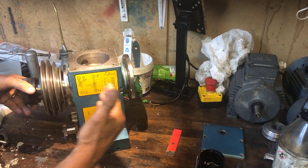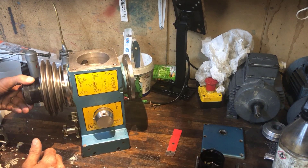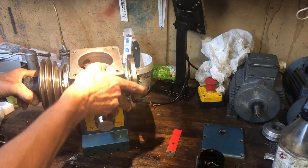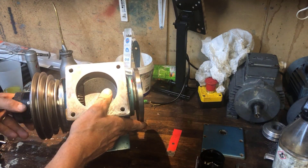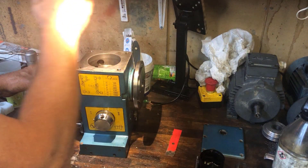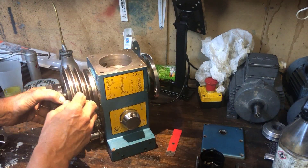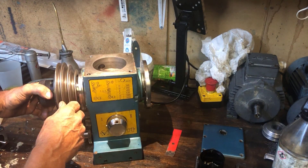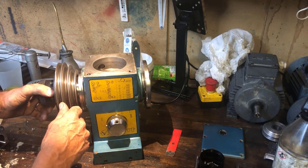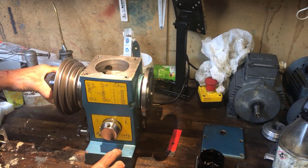The way to move between lathe and mill is to just operate this clutch here. Free — this runs lathe; inside runs the mill. So the gear rotates and drives up through the shaft with the belt to the mill head. I'm not certain either if I'm going to retain this V-belt pulley. I may wish to mount a multi-rib pulley and a little bit larger motor. We'll see.